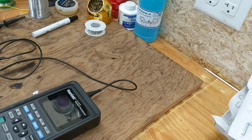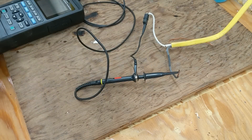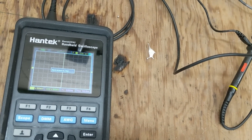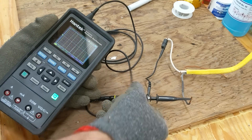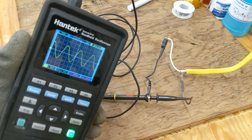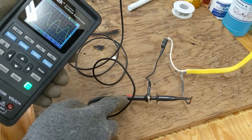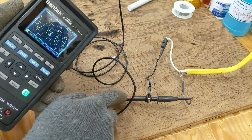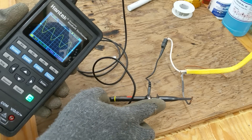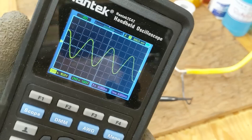Now to plug in the probes. If I pull down on the probe tip, a little hook shows. When I press auto, it looks like it's going off the screen. It turns out this little switch on the probe — when I went to pull it I must have inadvertently switched it to one times. That was a mistake on my part and that's why it was off the screen. I just switched it down to 10 times where it's supposed to be, and there's the sine wave.